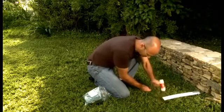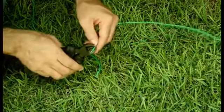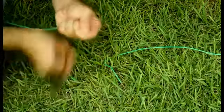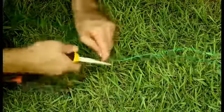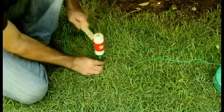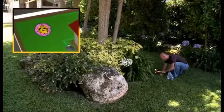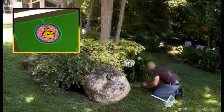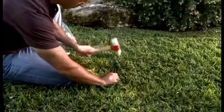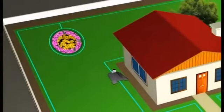Use the RoboRuler for accurate placement of the wire when bypassing obstacles at the lawn edges. When additional wire is required to complete the wire setup, use the connectors provided with the product. Strip the wire ends and twist them together into the silicon-filled wire nuts. Make sure they are tightly secured. When the edges of obstacles are too low or too soft to be detected by RoboMow's bumpers, use the perimeter wire to create a perimeter island around the obstacle. Apply the same method for flower beds, young trees and ponds.